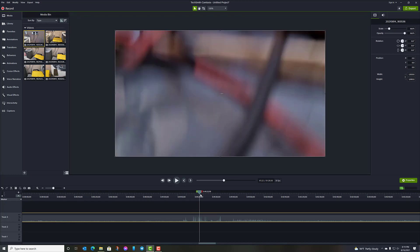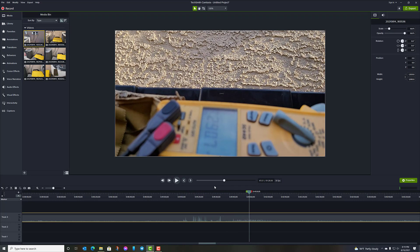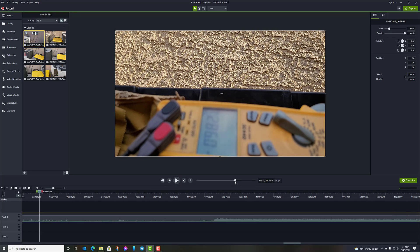There I am — I come out there and grab the meter and turn it back on. That unit was still running. Voltage is down to 290 there. About an hour into it the meter's getting ready to shut off. This beep sometimes — I think it got a high voltage reading on it. Right here is probably when the Goodman unit starts right next to it.